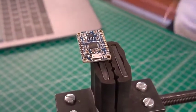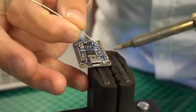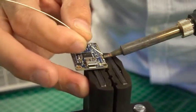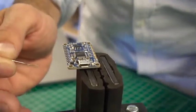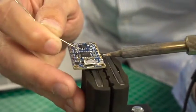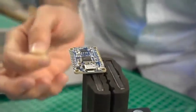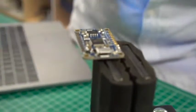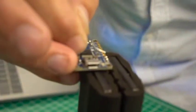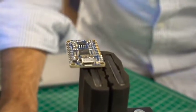Let me do another one. I will do one and then I will let you guys try it. Notice that I am putting the heat away from all the circuitry. If you can rest your wrist on something, you will get a steadier hand. That is a pretty clean connection. Sometimes it might be dull — if it is dull and not shiny, that is called a cold solder and it is not as effective. One thing you do not want to do is have solder cross into another pin. Those things need to be separated by their insulative property, otherwise your things are not going to work.